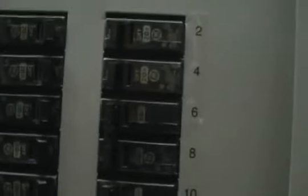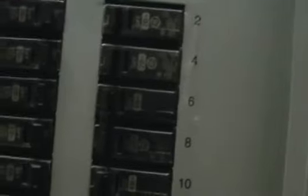There's no breaker right here. Let me check this — 40, 40, 40 amps. I'm not sure what kilowatt would run on 40 amps. I know 5 kilowatt runs off of 30 amps. So it's probably 7 kilowatts of heat, but I don't see that in here — all I see is it right here in the box. This is a 30-amp disconnect.